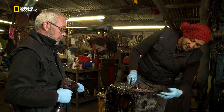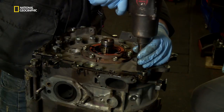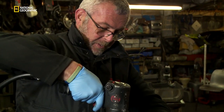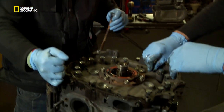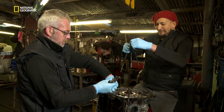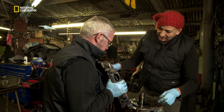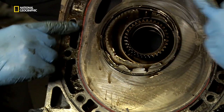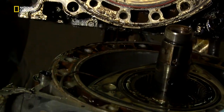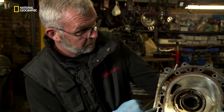Are there gaskets between each section? Yes — you have a water gasket which sits in the end plates, with an inner water seal and an outer water seal. These are really long bolts. Now we're ready to lift off the rear plate — lift it nice and gently. We were saying about the water seals: you've got the center seal, the orange seal — that's the inner seal — and then the black one which sits in the outer groove around the outside.